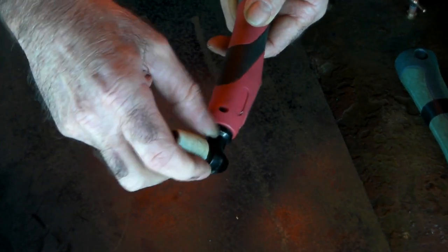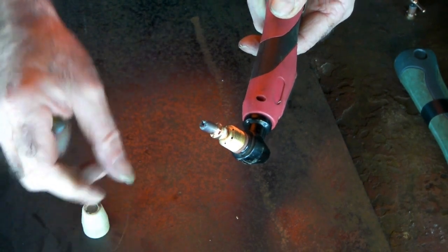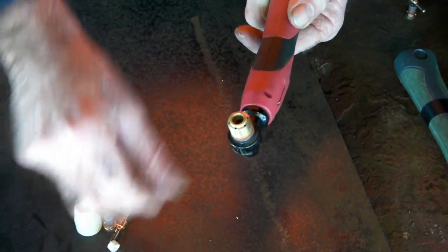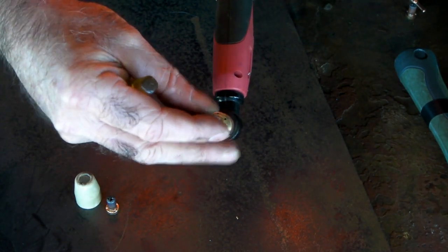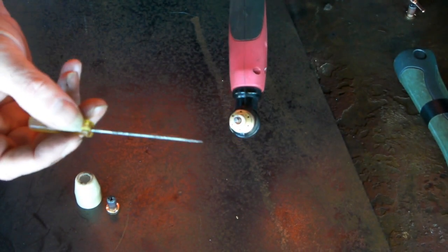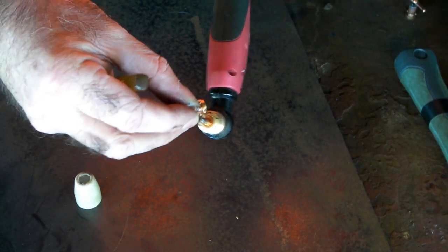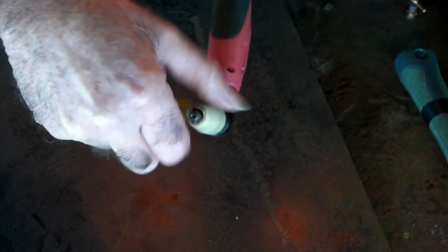The PT31 will probably have a few more issues than the AG60, but the torches and consumables are cheaper so you've got to expect a little bit of stuff to put up with. As you guys know, these are all reversible tips. The main problem I've found with these torches - and I don't know if it's just me or you guys as well - is that sometimes when you put your consumables into the torch they don't fit properly. You've got your double-ended electrode, your swirl ring, and your cutting tip. We'll put them together and I'll show you exactly what I mean.